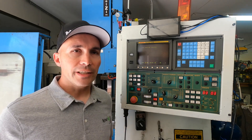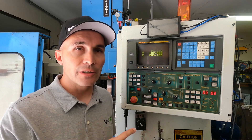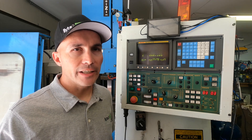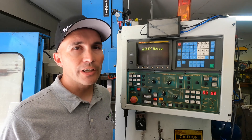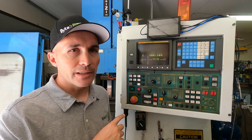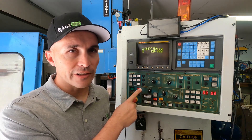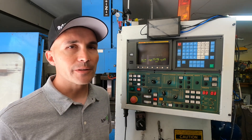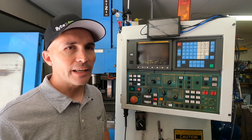Tape mode is really a way for us to send the G-code from the computer one line at a time. Some people call this drip feeding, but it's really a good way to have your G-code stored in your computer and sent line by line into the machine. I do this because Fusion 360 generates so much G-code that it doesn't actually fit in the memory in my machine, so I have to send it line by line every time. There are different reasons for doing that, but that's why I do it.